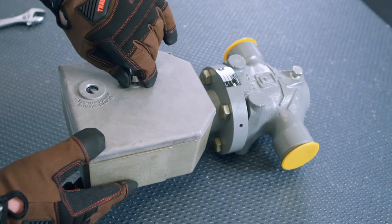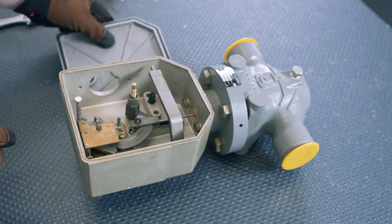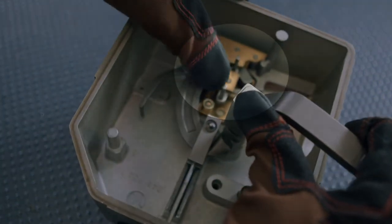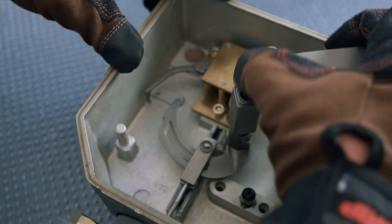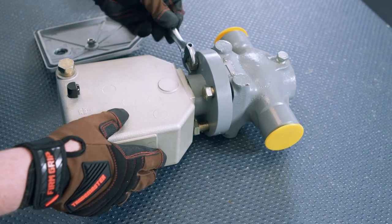The maintenance on a Type OSC device can broadly be divided into main valve and the manometric sensing device. Let's start with the main valve. Open the mechanism cover, then trip the mechanism if it is not already released by moving pin D1.